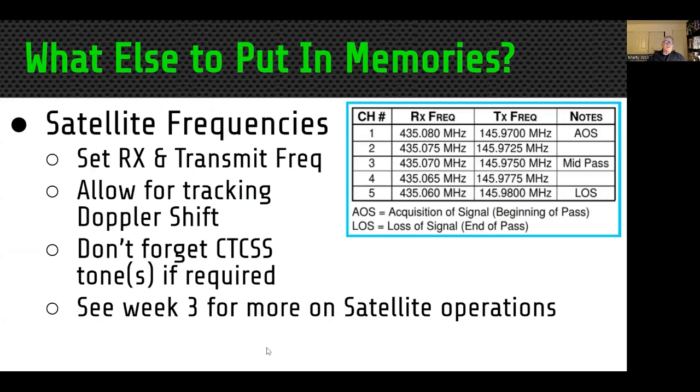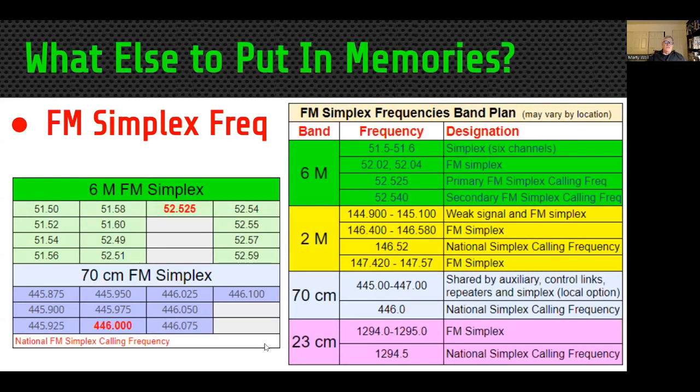Yeah, and Anthony, that particular table would not work for Southern California. Correct. We have typically 3 to 4 co-channeled repeaters on every available pair. It's that dense, and of course we use 20 kilohertz spacing instead of 25 like most of the country, just to try and squeeze more in.